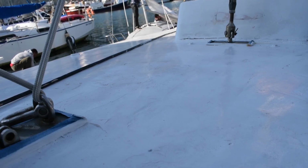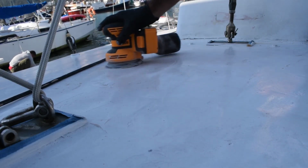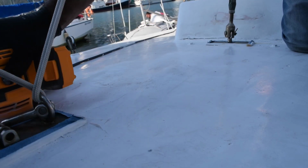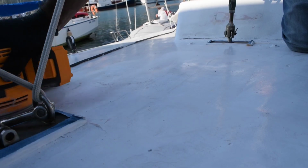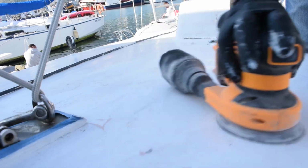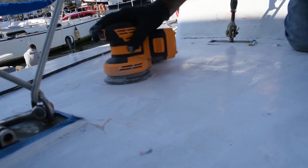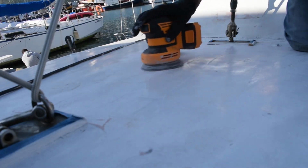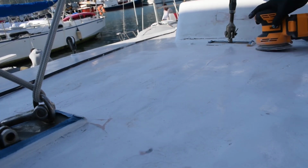Yes, this part of the deck. So the point is to scuff this up a little bit more and smooth it out, because I want to come through and put a little bit more fairing in, and this will be the last little bit of finesse work I'm doing on this part of the deck before I paint it. So that'll be in the next video for sure, if the weather holds out. And today's a perfect day to do fairing, because there's this beautiful northerly hot wind coming off of the mountains, and there's no condensation or anything anywhere. It's a fantastic day to do that, so I'm going to do that.